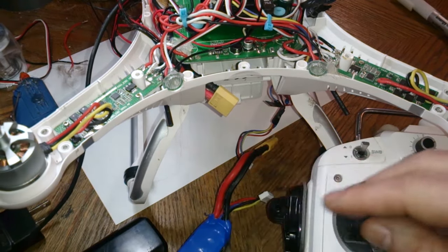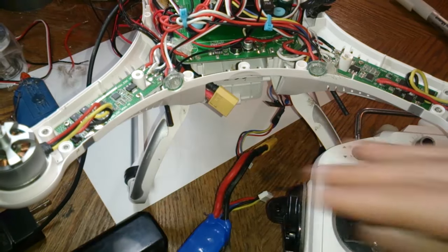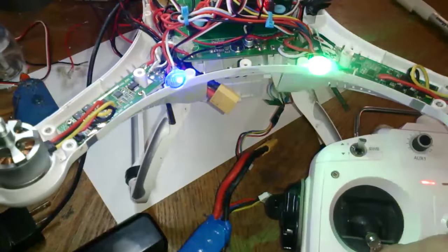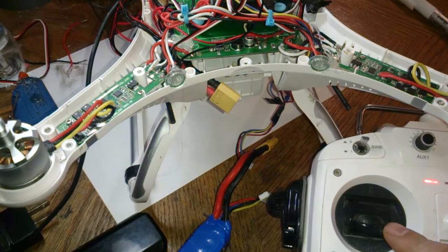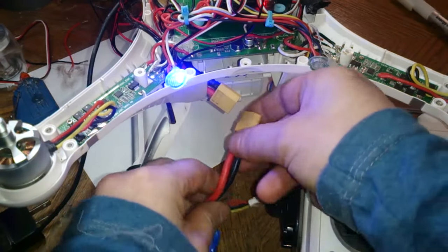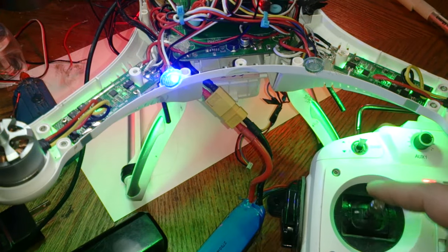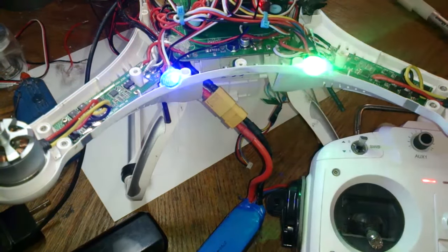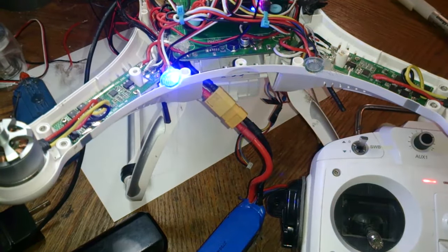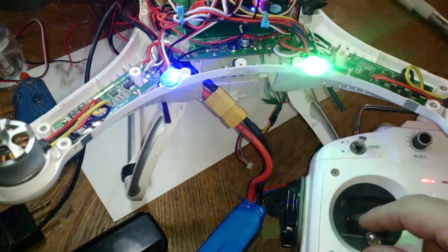So everything has to be a motion. First plug in the APM. Turn on your remote. Arm it, wait for that red light to go solid up in the corner there, go full throttle, plug in the battery, those two beeps there, and push it down. And that's it. After you hear that musical tone there, and if it's all quiet, you can move your throttle up, and all four motors should turn at the same time.